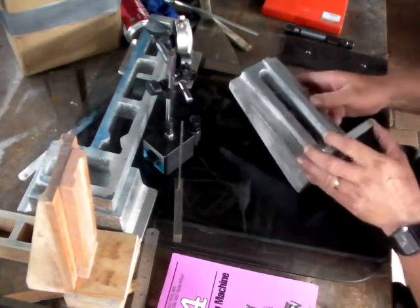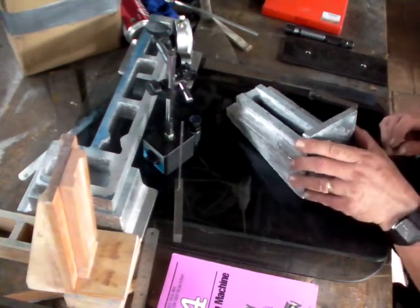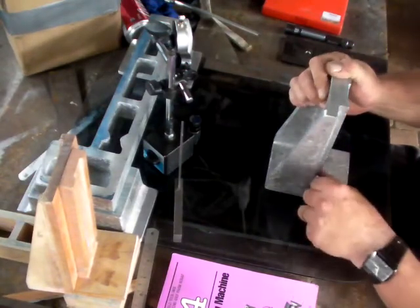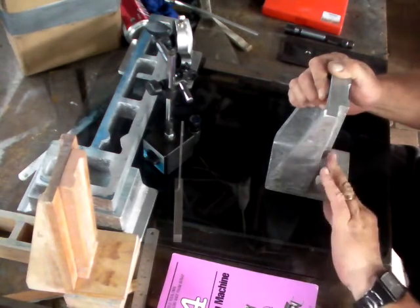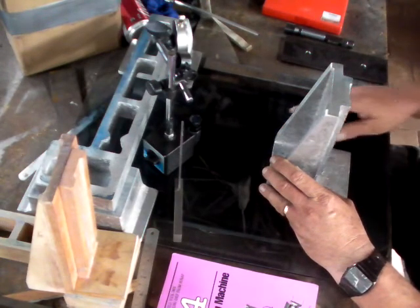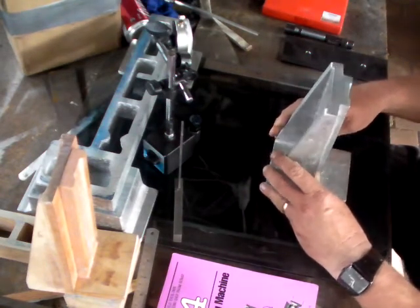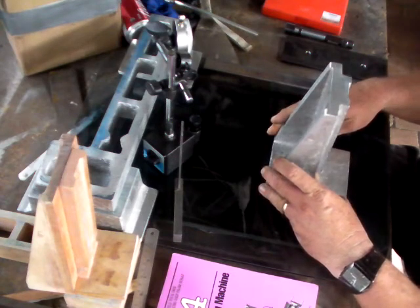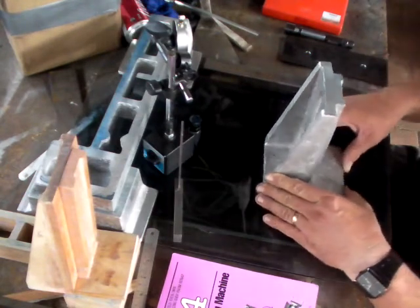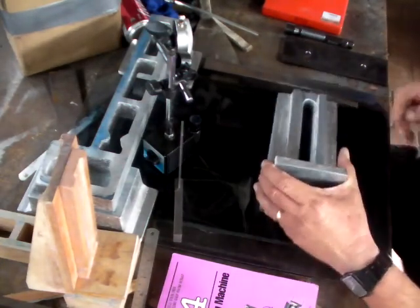The first surface was here — the base. I wanted this to be my reference. The base is important in that these ways, these faces here, have to be 90 degrees to the bed ways. Also not kicking over to the left or to the right, and you don't want the casting to be on an angle. So the first order was to get a nice clean datum.